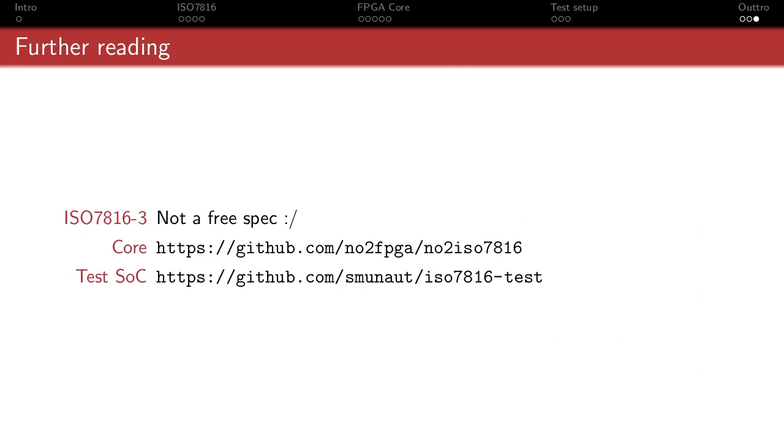And the maximum value that it can have is very large, so it needs a long number of bits, which implies that you need a fairly large register, I think it's 24 bits, to store the configured value, and then you need another register to actually count, and then you have some logic that can't be optimized out. It's definitely bigger than I expect.